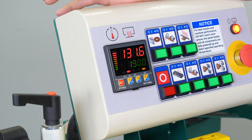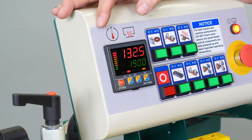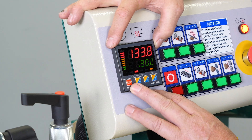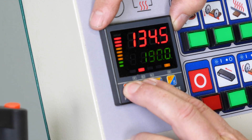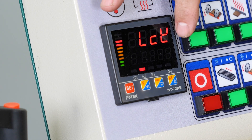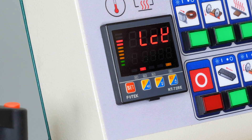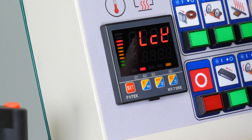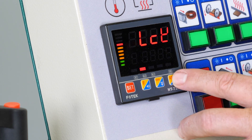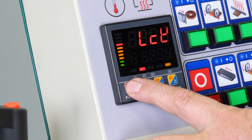Now I want to show you how to check whether the parameter setting is in locked or unlocked mode. To access the parameter setting, press and hold both the set key and the F key simultaneously for five seconds. You should see a value displayed — we want to make sure it shows a one. If it is in the zero mode, that means your parameter settings can be accessed inside the controller, which you don't want, because changes there will affect how your controller functions. Change it back to one, then hit the step button to return the controller to normal operation mode.